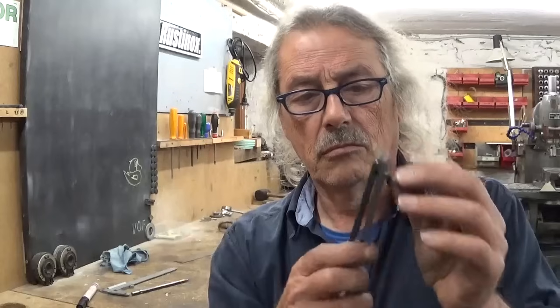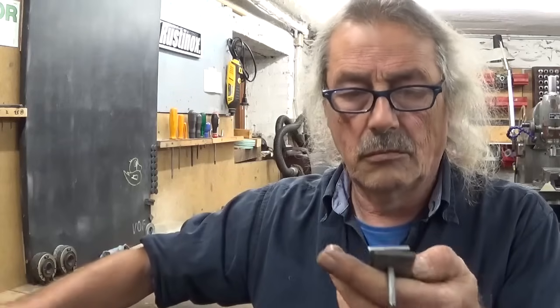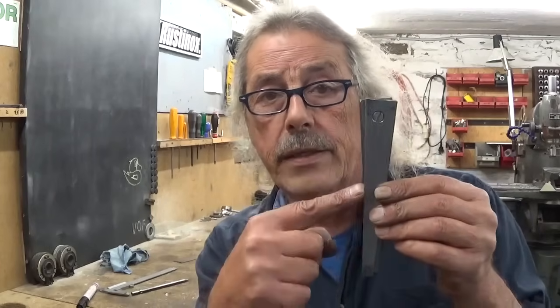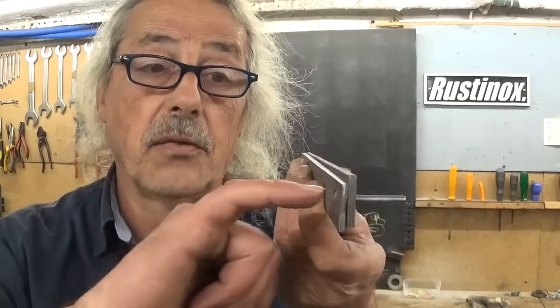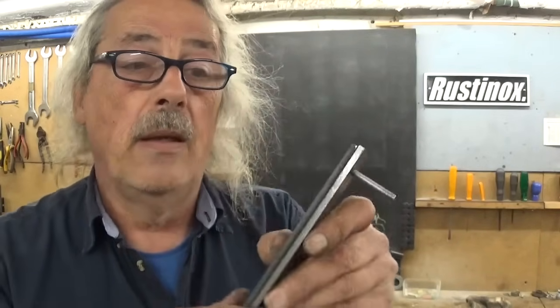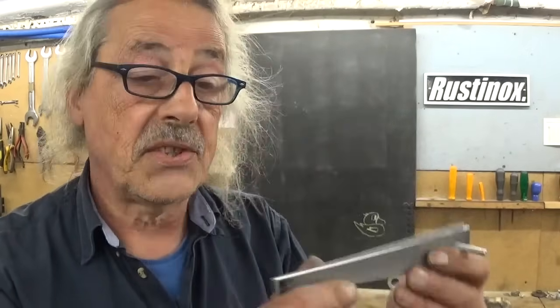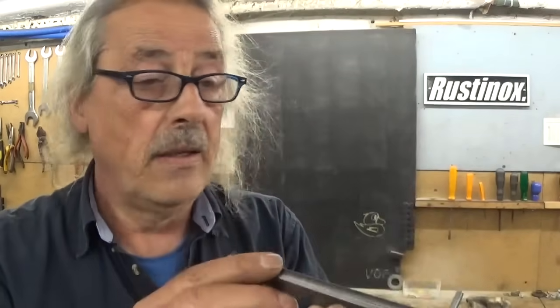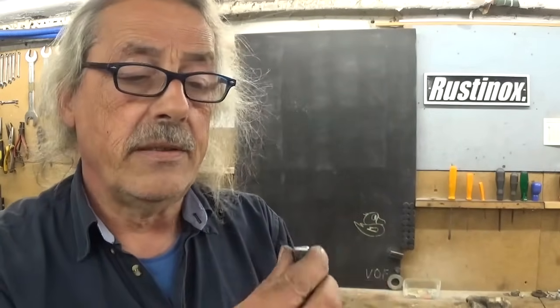Success! The trick will be now to make this thing look like this other thing. Before I start machining — as you can see I don't have the same height on either side — I installed a screw nice and deep and I will cut off this bolt so I can put it in a vise and then machine both sides.